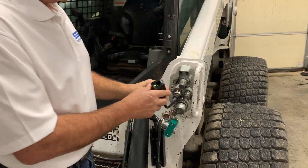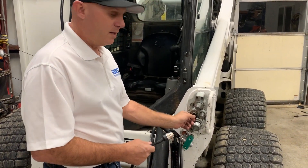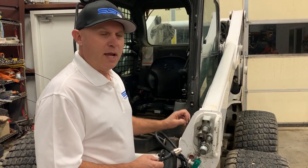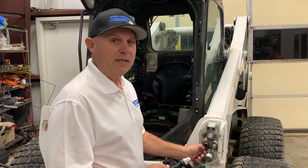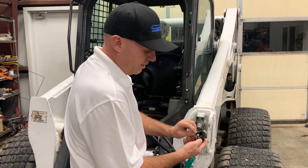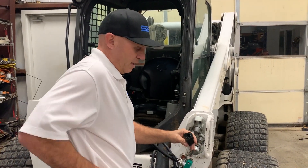If there's a problem and the controller comes up with no light when you plug it in, that means you've got no power and there's got to be a reason for that. I get in here and put a meter across pins one and three. Inside these connectors there are three power pins — a ground and two power — and then four CAN bus pins. The bigger pins are the power pins, the smaller pins are the signal pins, and they're labeled 1, 2, 3 and then A, B, C, D. It's labeled on the front of these. I just plug this in, get a little flicker telling me I've got power, I'm talking to the bus, and I'm ready to go.